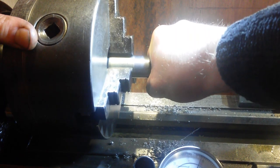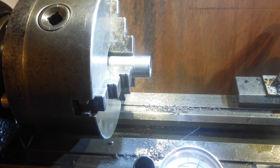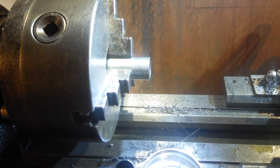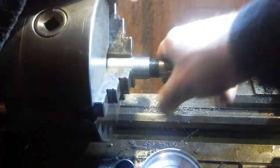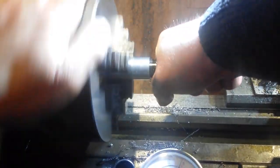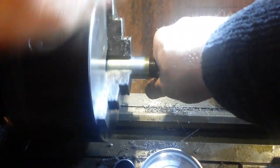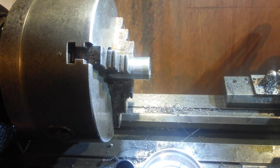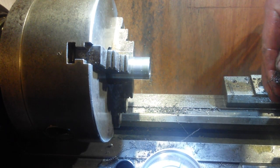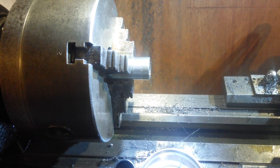Starts, that's a good sign. No, I think I start properly. Still some... My lathe cuts a small taper, so the threads are loose at the start now and really tight at the end. So just one more thousandth and I think I'll get it screwed in enough, that'd be perfect. Too loose at the start and too tight at the end.